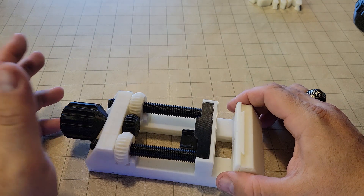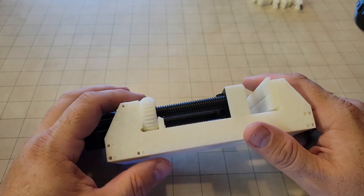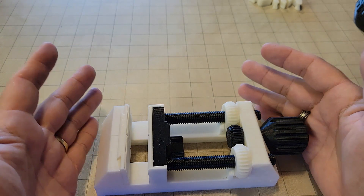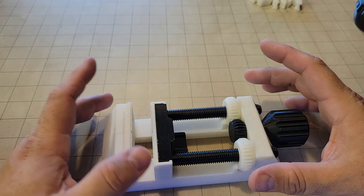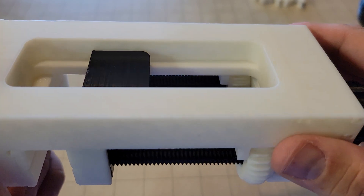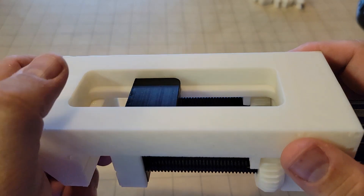It's nice to have a little vise that cost me about a dollar to make, because that's about how much filament it used. If you didn't know, 3D printers don't necessarily print solid — they print a honeycombed structure inside. The exterior layers are solid, as are the bottom and tops. But the interior is all this honeycomb stuff. You can kind of see it right in here — you can see the honeycomb structure sitting back in there.